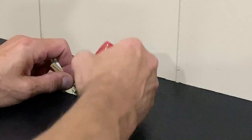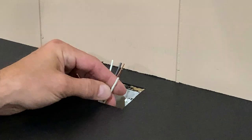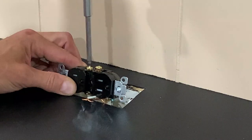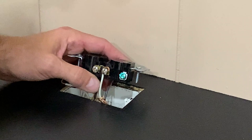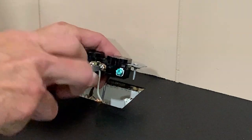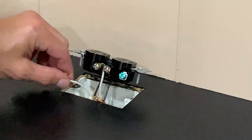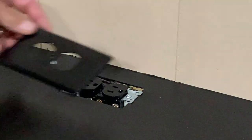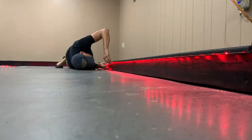Not everyone knows how to wire an electrical outlet, so here in the US: peel back the Romex coating and the individual insulation on each wire, then hook the wire to the right — important when attaching to the terminals. On one side you'll have a short prong and a brass screw — that's where the black wire goes. On the other side, the tall prong has a silver screw — that's where the white wire goes. Hook each wire in the clockwise direction so that as you tighten the screw the wire stays with it. Facing it the other way may give you a poor connection. Finish up with a receptacle cover.